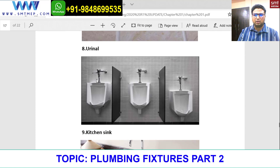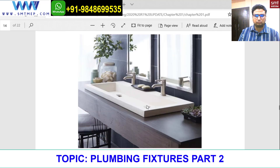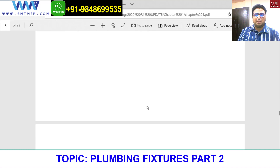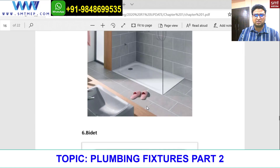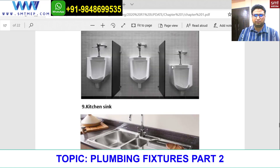I have a flush valve over here. Now, don't compare this flush valve with the ones in laboratories, because laboratory flush valves will have a very small amount of water. If I had huge pressure or a huge amount of water for cleaning, it might disturb and get on the clothes. So this is not the same flush valve — that flush valve is installed in respect to WCs only.